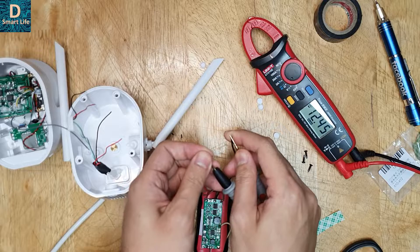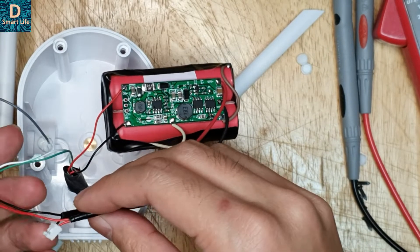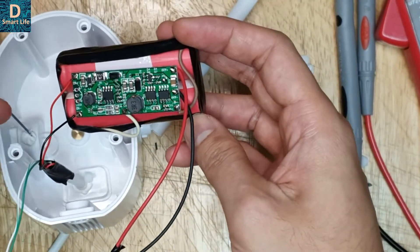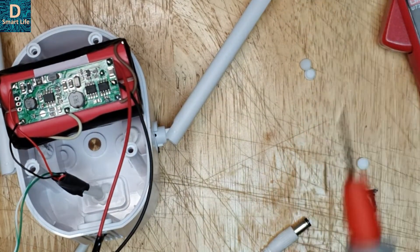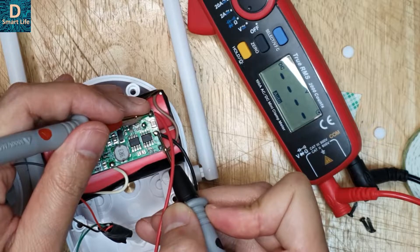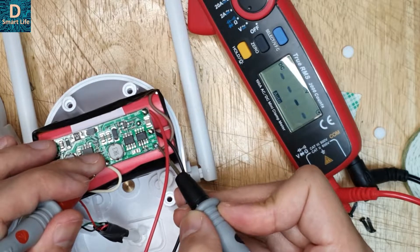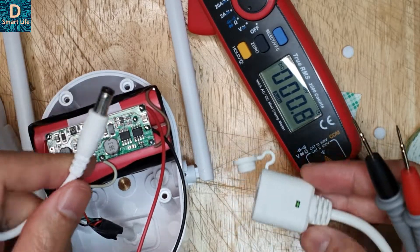As you can see, it's reading 12.44 volts. I've completed all the connections. The outputs are connected in parallel — one goes to the lower circuit board and one to the upper power supply board. The input comes from the 12 volt power source. Now we can test the charging current. Currently it should have 12 volt power supply — let's check the output: 12.45 volts. The input is not connected right now, so let's check the battery voltage: the battery is 3.91 volts.